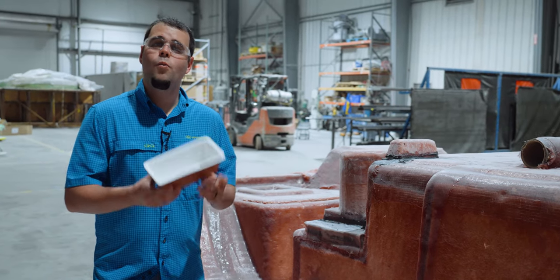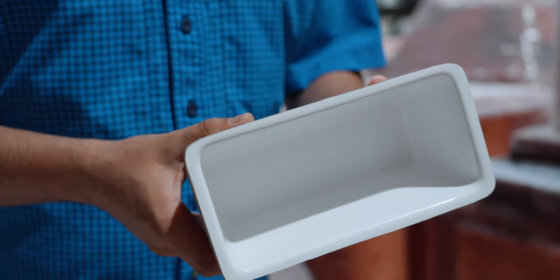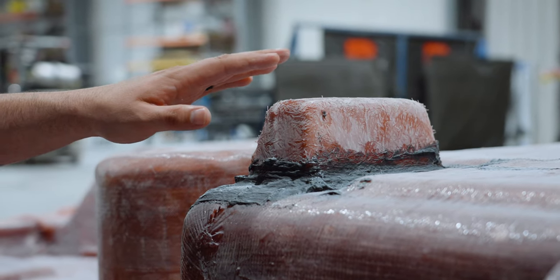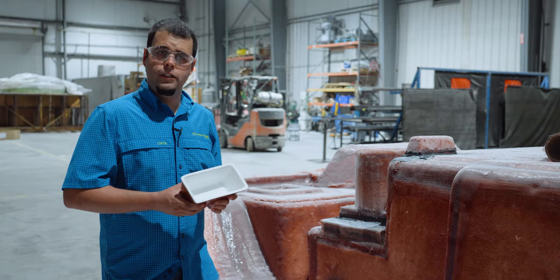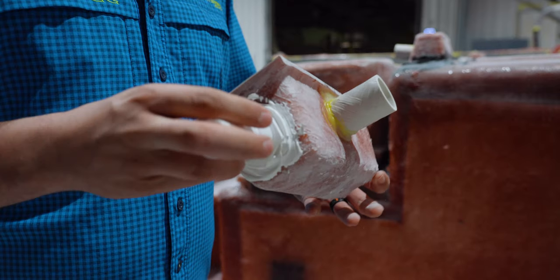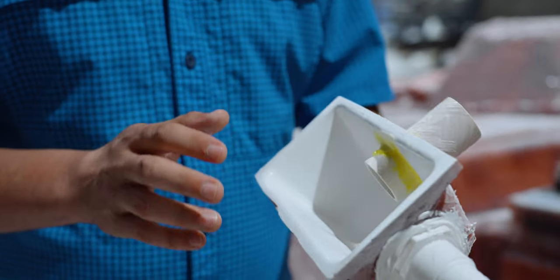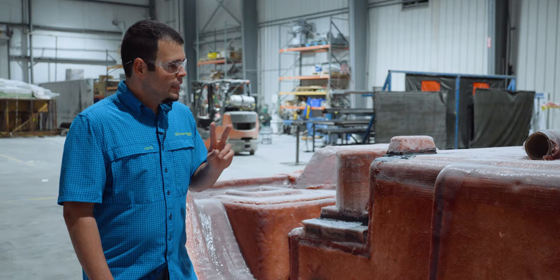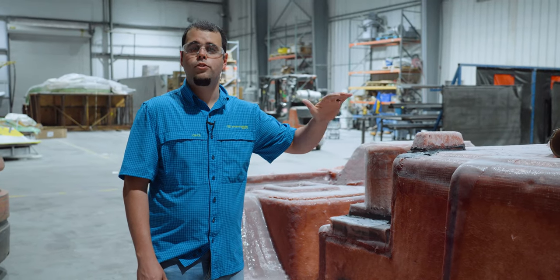Let's take a quick pause and talk about one of the other parts — a part that gets bonded to the underside of the deck as part of our self-bailing cockpit system. The way it works is any water that gets on the deck goes into this collector box and then gets piped overboard without going into the bilge. Using a collector box allows us to tie in different sources. One advantage is that we only need one through-hull per box, so we don't need a bunch of through-hulls on the backside of the boat. The second advantage is that it's at a different level than the deck, so debris simply goes into the box and keeps your deck completely clean.